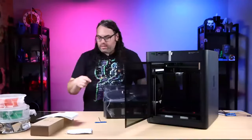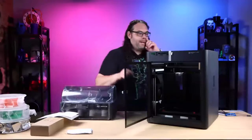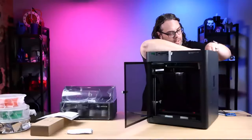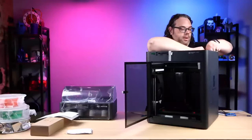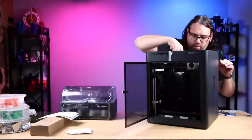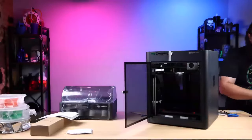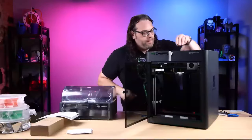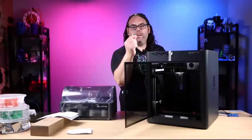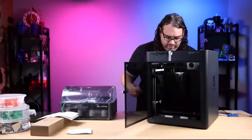The next thing to do is get the bottom locks off like normal, get the cardboard out, pull the lock out, and then connect the AMS. Pull these bottom locks off, pull the head of the machine out, cardboard down. If you have not seen my maintenance video on these machines - it is so easy to do maintenance. Don't forget your sticker on the hot end - I forgot that for a long time in my videos.